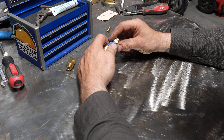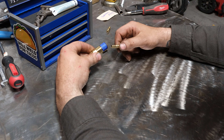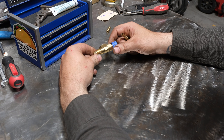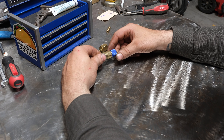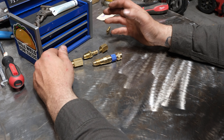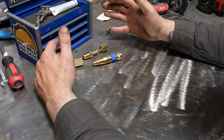If your plan is to take this on a mobile TIG welder and beat it up in the field — with mud and dirt packed in — and expect it not to leak, you're fooling yourself. These are not really designed for in-field use. You're still better off threading the gas fitting on by hand in tough conditions; it's far less of a headache.